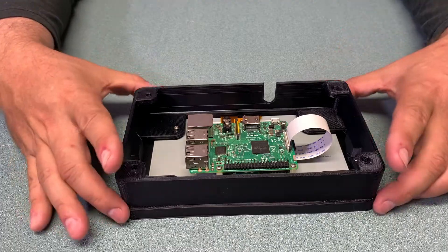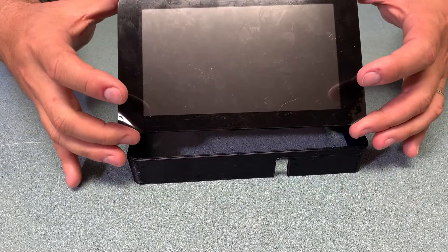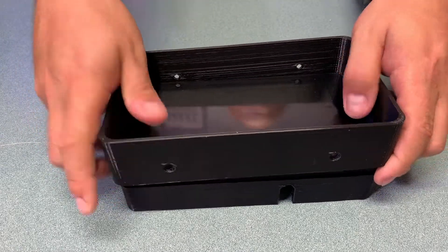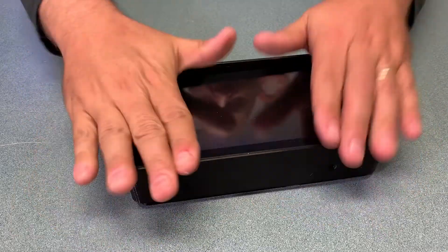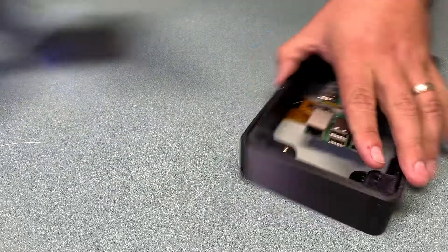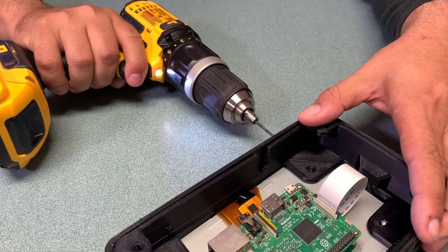Test fitting the base piece, you can see with the two of them together you get a pretty solid design, but it's also very easy to slip the top piece off — and I'm trying to avoid that when I install it on the wall permanently. To make it much more secure and prevent those two pieces from coming apart, I'm going to install the ring over top of it. The ring fits on quite nicely, and what it does is prevent the top piece from sliding upwards as it needs to in order to disengage from the base. To prevent the ring itself from being removed, I'm going to drill through the side through my screw holes into the inner piece just enough to have a pilot hole that the screws can follow.